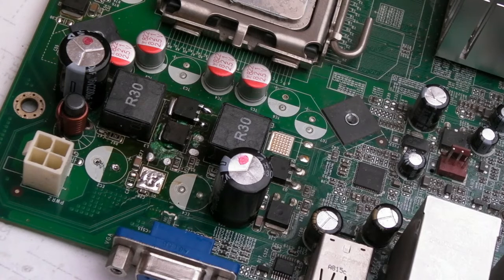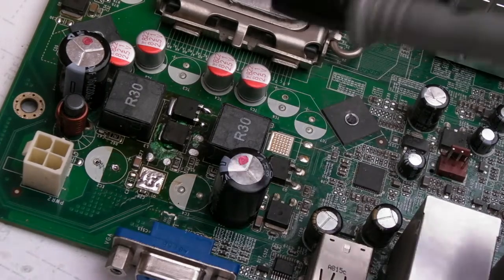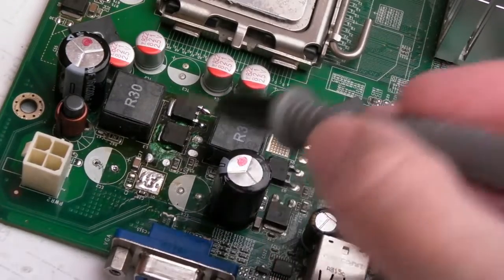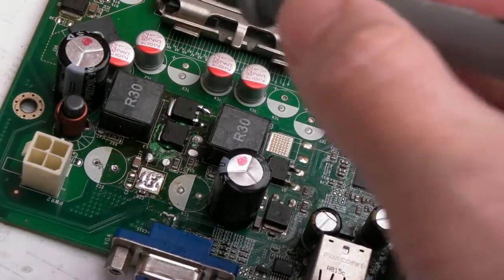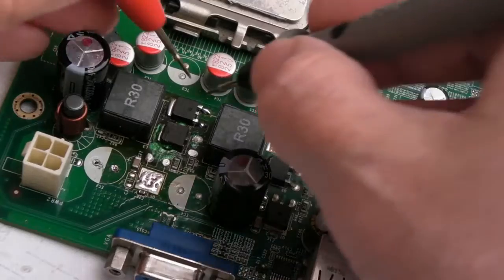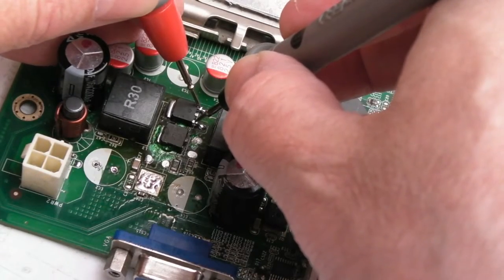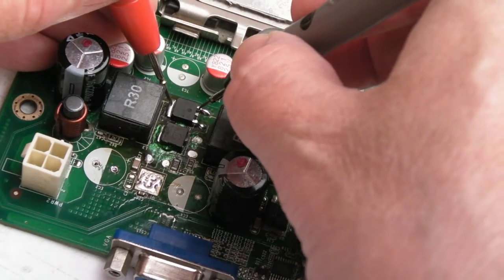So I'll still need to do a little bit more cleaning around there, because there's a little bit of flux from a minute ago where I added some solder to this pad in advance of this MOSFET turning up. There's perhaps a bit too much on there actually, so I'll remove some of that. If I just test on connectivity, so in terms of short, we don't have a short here anymore, so that's good. It's obviously worth checking that way.